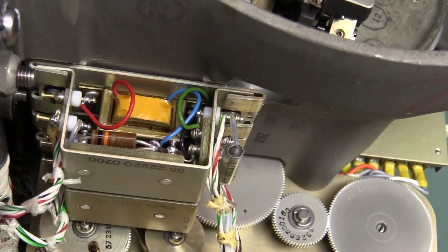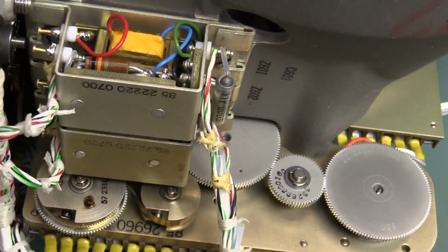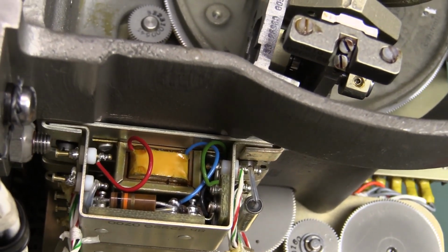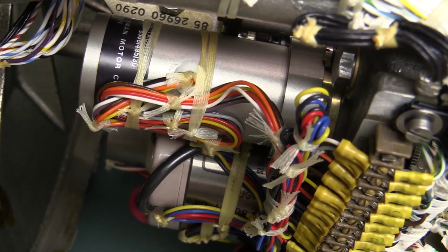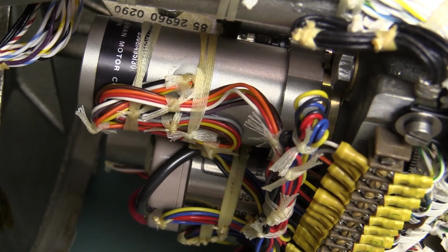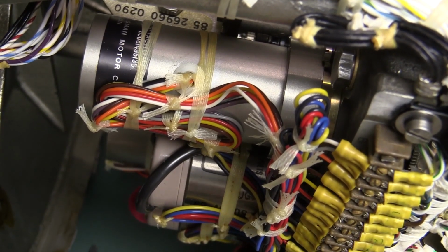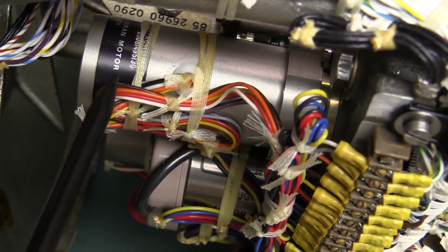And you can see, yes, we have a little bit of circuitry down in there. Look at that. Or do we have some sort of solenoid type thing? Perhaps? I don't know, but that's kind of the extent of the electronics inside this thing. It is one big mechanical computer. So we're going to have motors and sensors in this thing. Motors are the inputs, so you can think of those as the inputs to this control system, this analog computer, driving the motors, and then the motors drive the gears and the cogs, which do all the computation based on how many teeth they've got and the configuration of them. And then the outputs will come from sensors, hopefully rotational sensors and all that sort of stuff, which you can find.